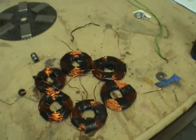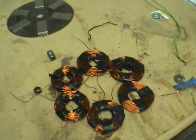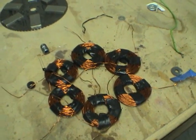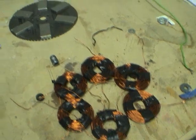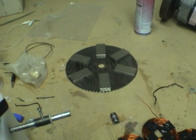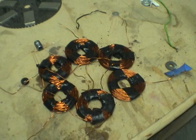So anyway, I'm about ready to add the resin to the stator. I've got to cut out a circle around that, get it all sealed in, and tie the wires together in parallel. Then I have to encase that in resin as well. I need to make sure all the magnets are lined up perfectly and spaced out perfectly, as well as the coils here.